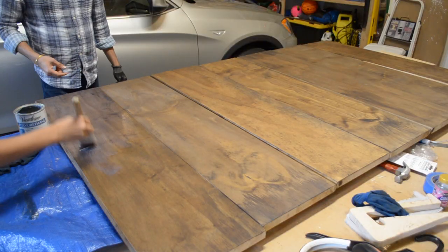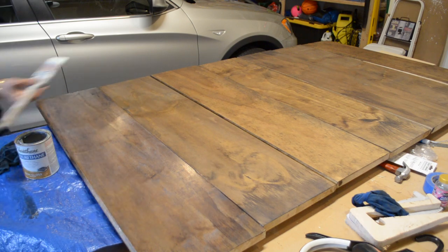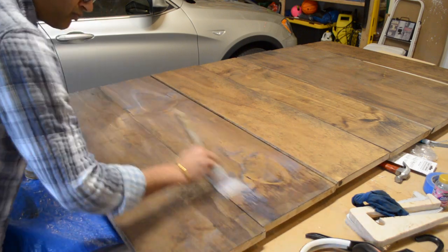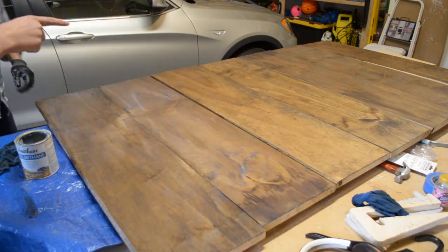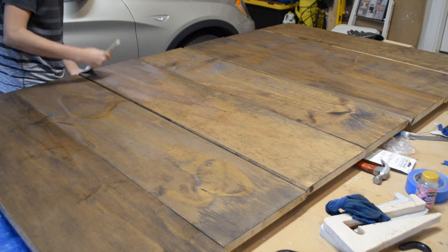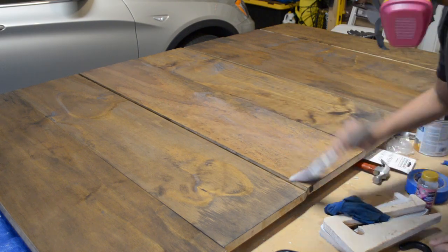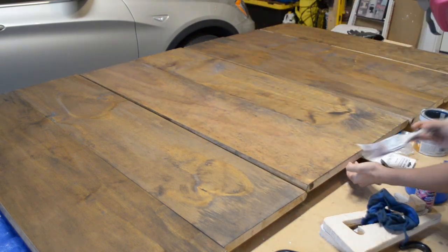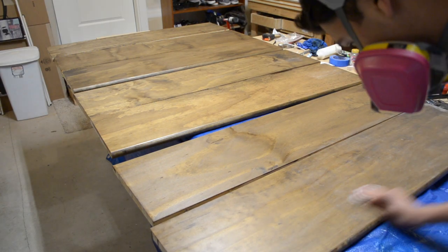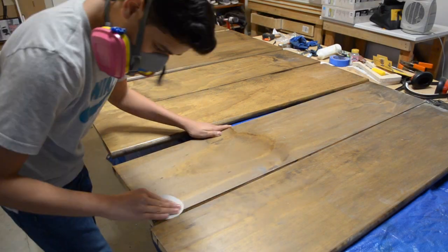After the wood had been stained, we applied 4 water-based polyurethane coats to the boards, sanding in between each coat. We chose this finish because it builds up a smooth film over the wood, which should provide some protection for it over the years. When we sanded the finish between coats, it was really softly with 220 grit sandpaper. The objective is to only smooth out the small bumps and imperfections in the finish, not to strip the finish off.